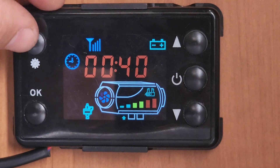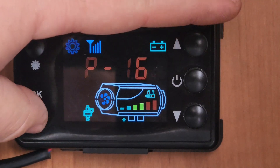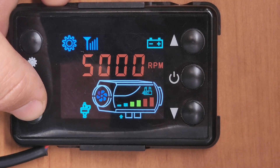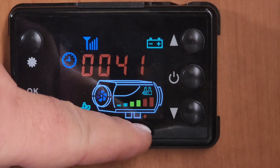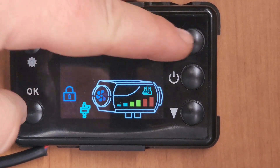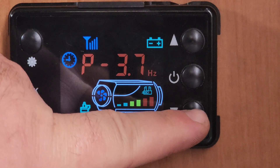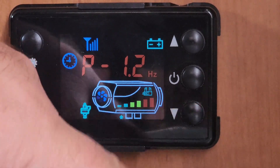As you can see, we've got two red lights back on again. This pump ended up being 3.7, but that's for 5000 RPM. So what we're going to do now is go back through and put it onto the minimum. So 3.7 is the highest we're going to have it at for this exercise — I might even put it at 3.8, so it's 0.1 above the minimum fuel delivery required. Now I'll put this down to the low setting and let it wind down. We'll go down to 1.2.